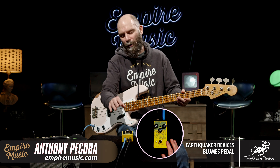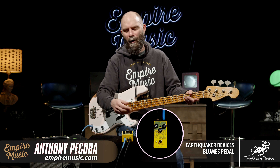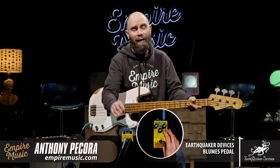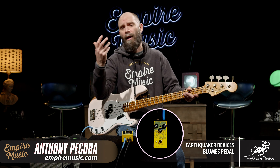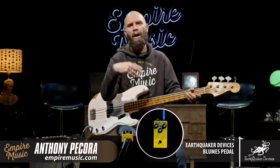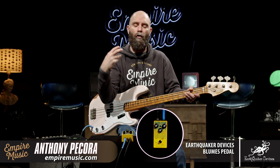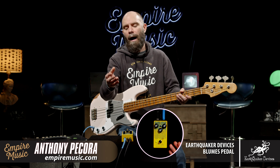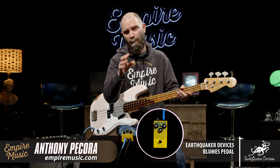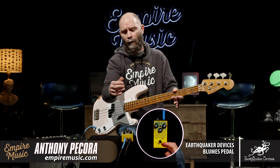Spec-wise, the color scheme is cool with the yellow and green. You've got a level control — that's the amount of signal going into the effects box. Gain is the amount of drive. Then tone, which functions very similar to a tone knob on your instrument — rolled all the way back accentuates low end and sounds a little muffled; go clockwise and it brings out some highs and crispness. Three separate modes: mode one is LED clipping, mode two is op amp clean boost with no clipping at all, and mode three is symmetrical silicon diode clipping.